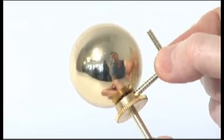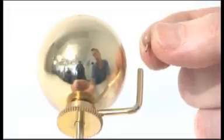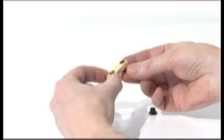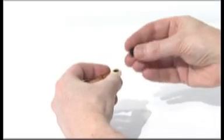Slot the Mercury planet arm into the side hole in the driving gear. Lock it with an M3G grub screw. Place planet Mercury into the pin hole at the top of the planet arm. Now build the first small gear set — there will be a smaller gear set for each planet, so take time to get the assembly correct.